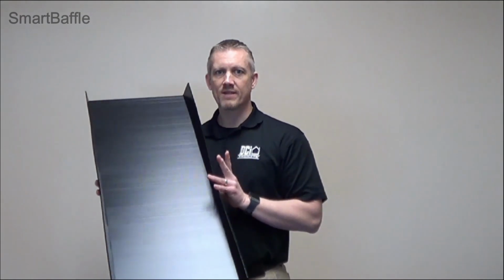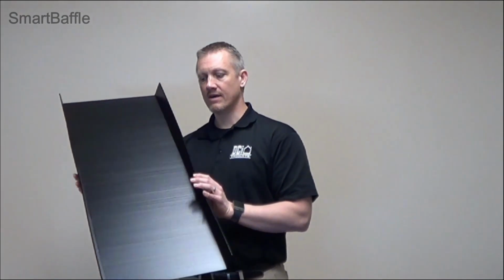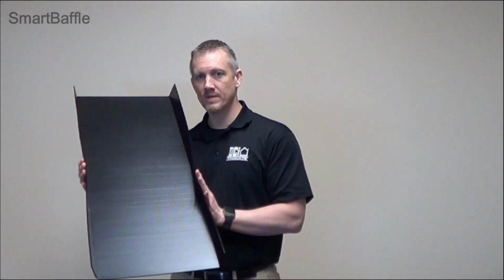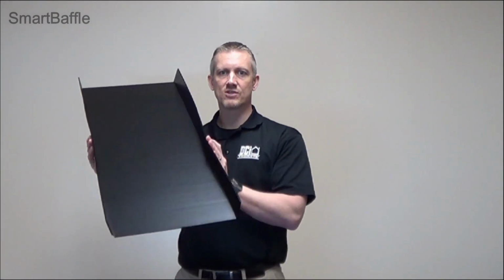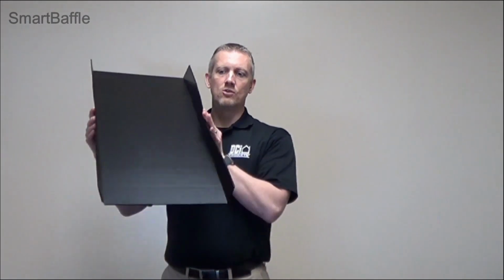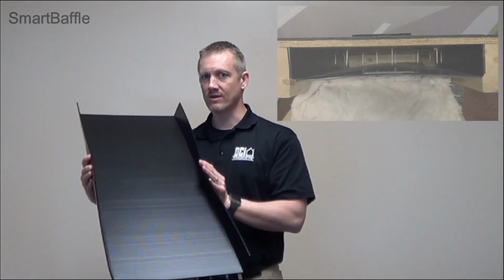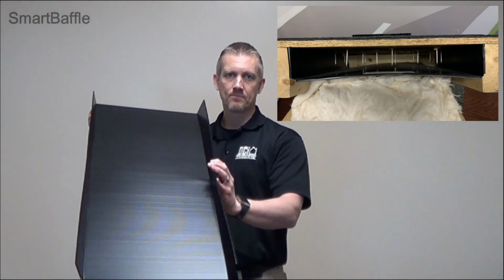We're going to start with inside the attic. So when you're inside the attic, there's a few different variations of how you can install them. One of them is installing it with the nailing flanges up. So you push it down. The benefit is it's going to bypass all the roofing nails, and you secure it right from the bottom.